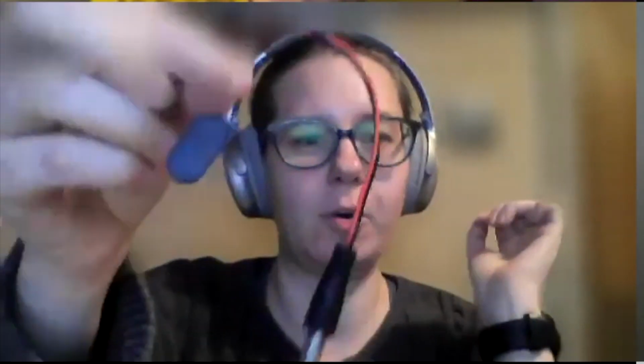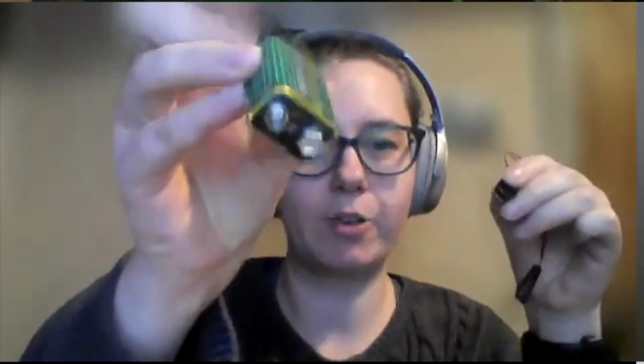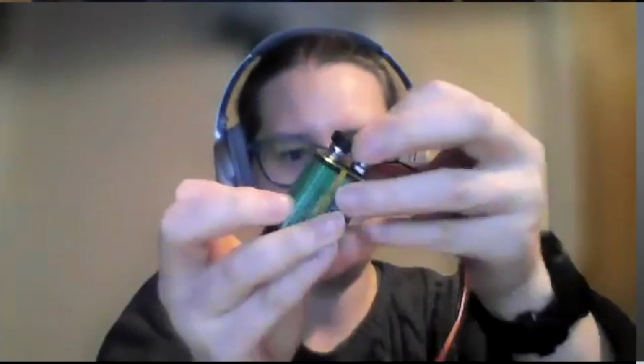Right, so I'm going to stop. Oh, sorry. I was just going to say, Luke had a very good question in the chat about how to unplug an Arduino from the computer and still have the circuit on, so you can hang it up somewhere. I just wanted to show that in your boxes, if you've got one of the Arduino kits, there is a little cable that looks like this, and a 9-volt battery. You can connect the battery to this, and then the other end goes in another spot on your Arduino next to the USB cable. You don't want to plug that in while it's connected to the computer, so make sure you've unplugged it first.